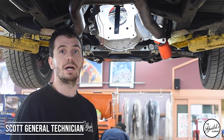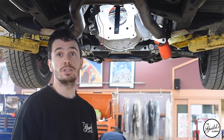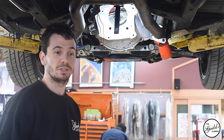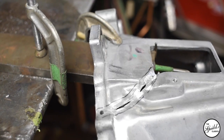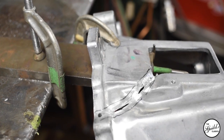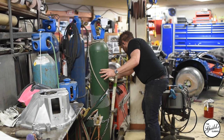In these engines you're supposed to have a neutral balance flywheel, and unfortunately the flywheel that came in this one wasn't. It was incorrect for the engine, and that started a vibration which backed all the bell housing bolts out, and that caused the whole engine and transmission assembly to essentially clamshell and create stress fractures.